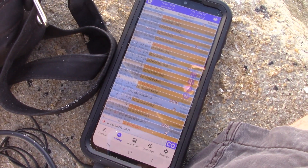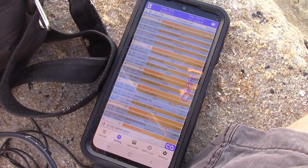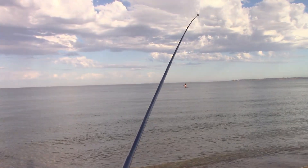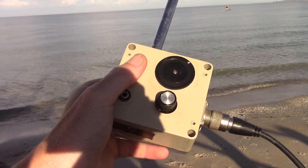After that initial success, I've been calling on 30 meters with no more luck, so I'll try some of the other bands. Noting that as it gets lighter in the morning, the conditions will be better on the higher HF bands, and another factor is this antenna will be a lot more efficient there.